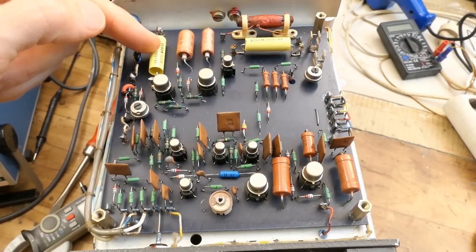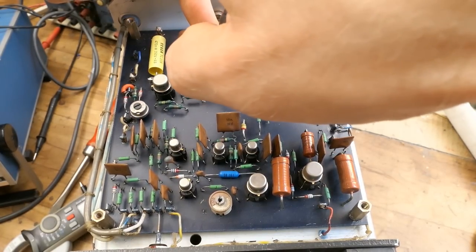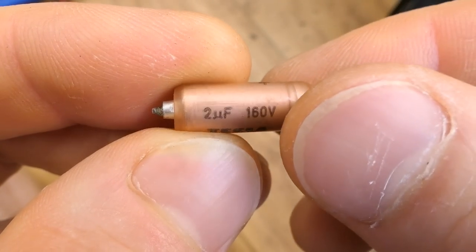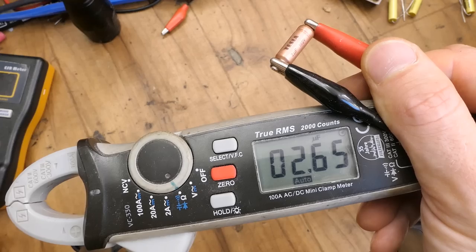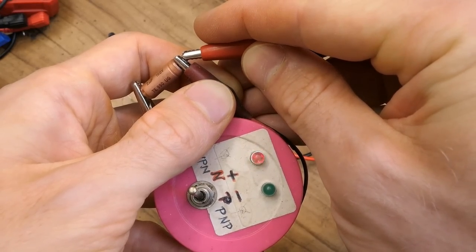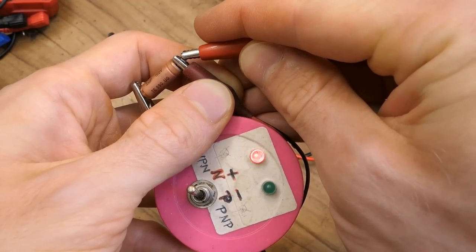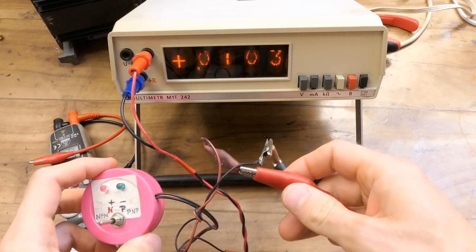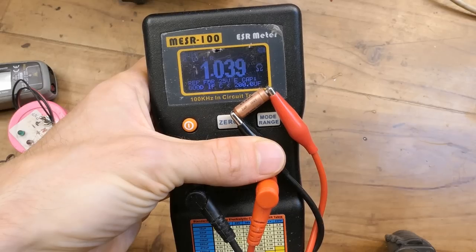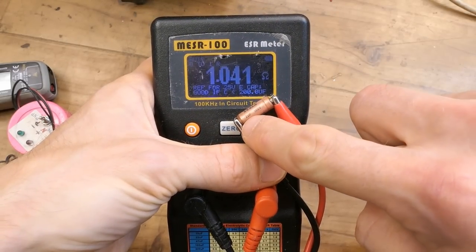These polyester capacitors are in the voltage feedback of the high voltage power supply, as well as this small electrolytic one which is coming next — 2 microfarads, 160 volts. It's reading 2.65 microfarads, and this one has a massive leakage current. Even if I pre-charge it, it self-discharges and the leakage current comes back — it's leaking about 10 microamps at just 10 volts, rated 160 volts. Measuring the ESR and it's just 1 ohm, which is actually not bad for such low capacitance like 2 microfarads.